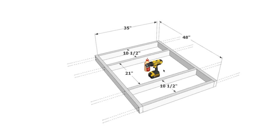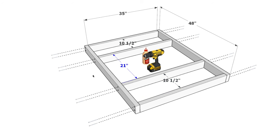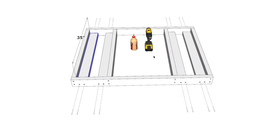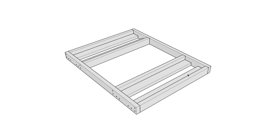Next, let's talk about creating the entrance of the doghouse. You need two 48-inch 2x4s and a total of four 35-inch pieces, assembled with 10.5-inch gaps between them and a 21-inch gap for the entrance. Once measured, pre-drill, secure with wood glue and 3.5-inch screws. Then add four more 35-inch 2x4s perpendicular to the originals — secure with 3.5-inch screws, pre-drill, and use wood glue. You only need one of these since this is the entrance panel.